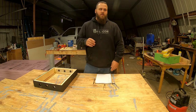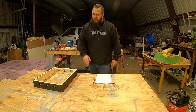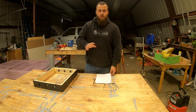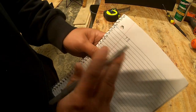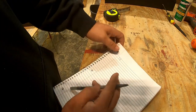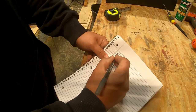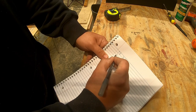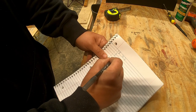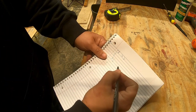So we need to figure out what length and width we need for each side. Let's go ahead and get to the paper here and start writing stuff down. So we know for our deep boxes, they're 9 and 5 eighths — let's say from here to here — and we're going to have two of those. And then we've got our inner cover, which is 3 quarters of an inch. We've got our Vivaldi board, which is 3 and a quarter inches. And we have the shim, which I made for 1 inch for height.